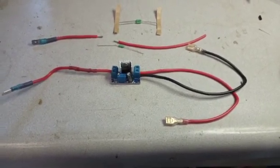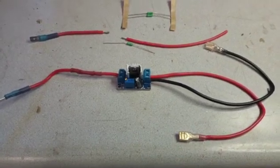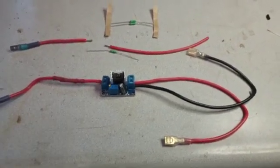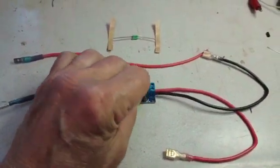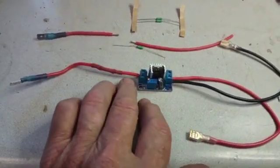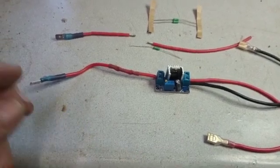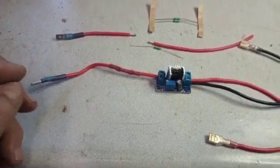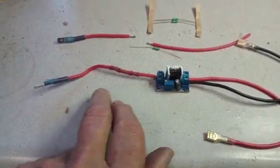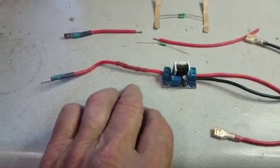This may be my last video on this regulator for the Volkswagen fuel gauges. I've got a regulator here, and the way I wired it up is this would be the lead right here that would go hooked to your ignition switch wire that comes up that you would normally hook up to the vibrator or the regulator. The color is not black — I've got red for hot.